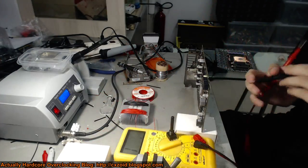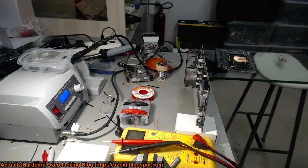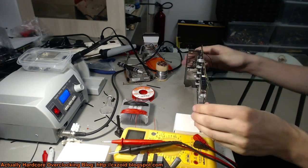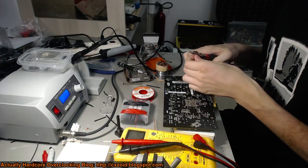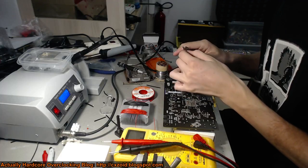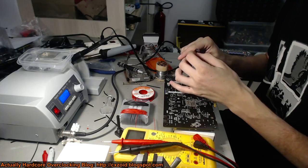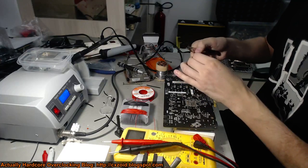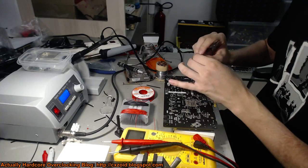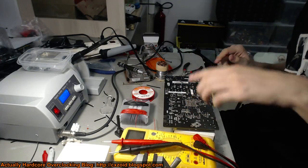Now I'll check that I have the wire on the pin I need, so I'm going to check the controller pinout one more time to make sure I didn't make anything wrong. It should be four pins over. So now I'll just strip the wire so I can read off of it to check that it's hooked up properly. Then I'll tin the wire, hook the wire up to the potentiometer, and put the card back together. That's the most basic volt mod you can do - it doesn't do any power adjustment, so you're still going to have power limits right now. Power limit removal on this controller is super, super easy, so I'll do that right after this. After that we'll look at the other controller - that one has a public datasheet, you can just Google the number.